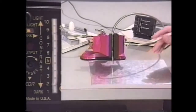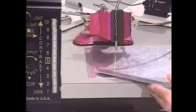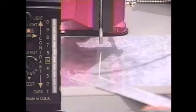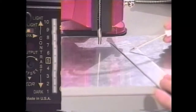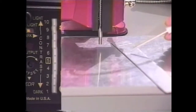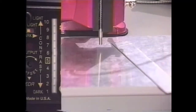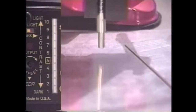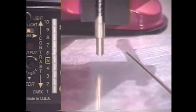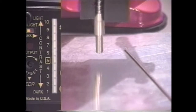This is a very shiny piece of aluminum, cut from aluminum stock — it's 1/16 of an inch thick. The sensing test here is to detect the presence of this 1/16 inch thick piece of aluminum resting on the aluminum background. This is a very difficult sensing test, particularly when you consider that the sensing distance is only about half an inch. We're going to shove this piece of metal in front of this sensor and expect the sensor to respond to it.